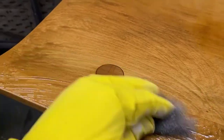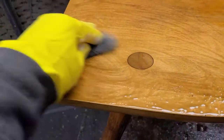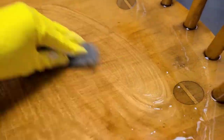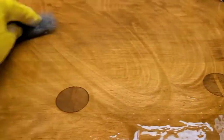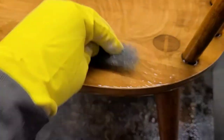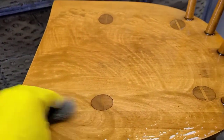I'm not trying to be super particular right now. All I'm trying to do is release the finish, and I'm going to go around with a towel and wipe it all off. It's not flammable, so you don't have to worry about those towels after the fact. This finish is just coming right off — you can see all that grime and old finish is scrubbing right off. I'm going to do that to the whole chair and then show you where we're at.